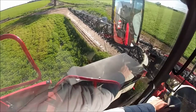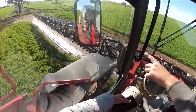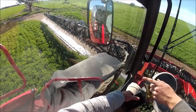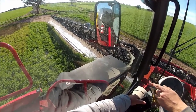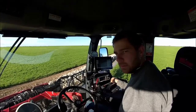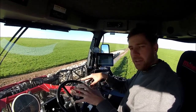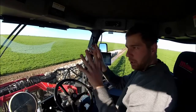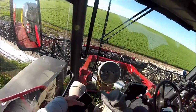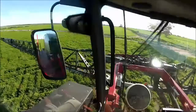You can see it's coming out there - there it goes. See the set of nozzles at the back, and then you've got the air boom with two big air fans. If I turn them down you'll watch the boom - as I turn it down the droplet sizes change. I can actually adjust on the fly, right back to a real fine mist just by adjusting the fan speed. Wind and droplet size - depending on your target and your crop, you can either run fine to get through a canopy. Tonight we'll be running pretty fine to really push it through the canopy and get the fungicide under. Some are knockdowns - when you're using roundup you want a coarse droplet depending on what you're trying to hit. It's a pretty handy thing to have.